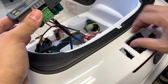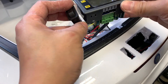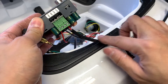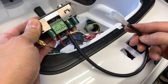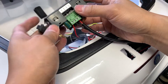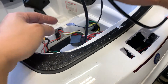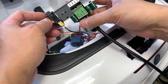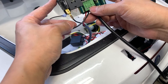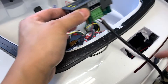The holes are cut — not the cleanest, but the switch will cover most of it. We have our switch here with the on/off power. For the wiring: the output goes into the controller with a two-pin harness, and the opposite end connects on the car itself. The battery end uses an XT60 connector — the positive goes straight to the converter, and the negative goes through the switch, so when you flip the switch it completes the circuit back into the converter.